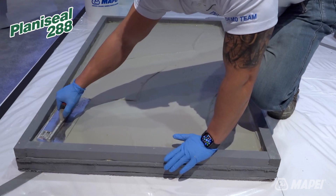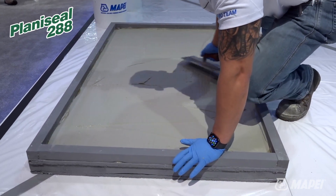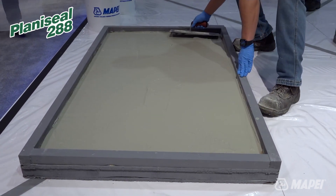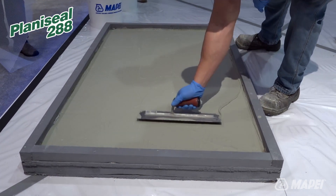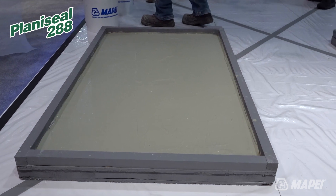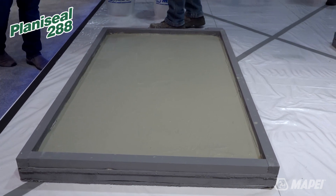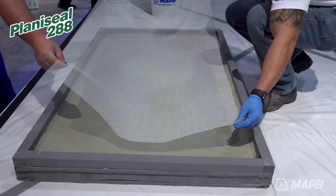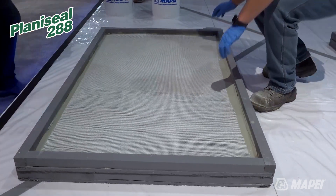Your sidewalk out front would be about a one, so that just gives you a point of reference — it needs to be a lot rougher than a sidewalk, something between a sidewalk and a street. By adding texture to the surface, you're actually creating more surface to bond to and increasing your bond strengths, because per square inch you actually have more than a square inch of contact. It's like going up and over a mountain range — it might be 10 miles straight across, but going up and over adds a lot more miles.